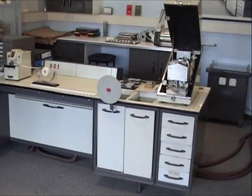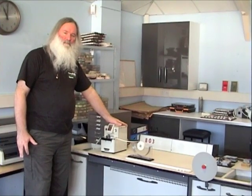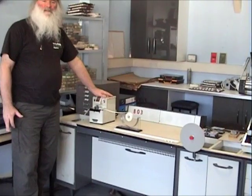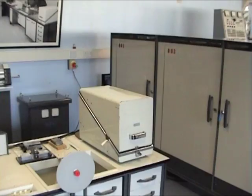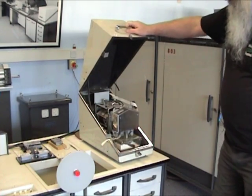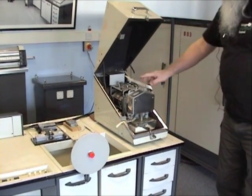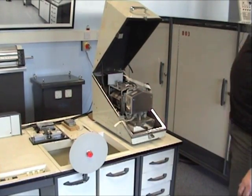We have added an extra circuit into the PTS which takes the place of the second tape reader and allows us to load large tapes from a PC. This reduces the wear on the reader and also removes the risk of ripping the tape when you wind it up afterwards. This is the paper tape punch, 100 characters a second. It will be taped from this side, punch head here, output there.